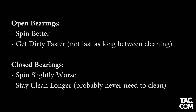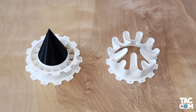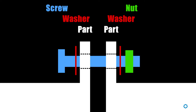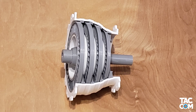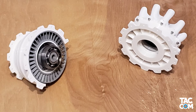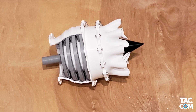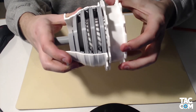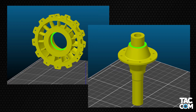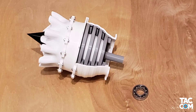It's time to start the final assembly. Start by gluing the nozzle cone, then bolt the mixer in place — this will take 13 screws and nuts and 26 washers. For most of these attachments, you'll be putting a washer on each side. Next, bolt the LPT shaft to the LPT hub using 8 screws and nuts and 16 washers. Now add a bearing to the LPT shaft. We're going to bolt the LPT module to the aft section with another 8 screws and nuts and 16 washers. The seating of this bearing will determine the clearance between the LPT rotors and stators. If you don't like the alignment, sand or file down the bearing seating in the axial direction until you get the result you want, then bolt it together.